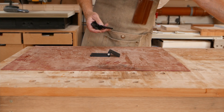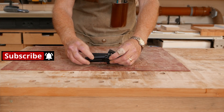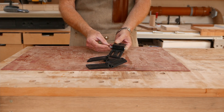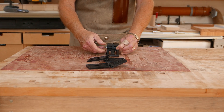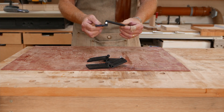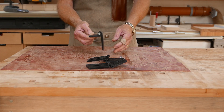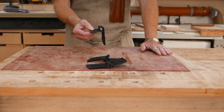It took a number of iterations to get it right — three to be exact — to get the hinge mechanism to fit together and fit together in the right place. And then voila, I've got a flip stop. It'll keep itself in place purely by tension, which is being brought to bear by this bolt with a nyloc nut at the end. The other nut on there is not required — my apologies, it shouldn't be there, lack of preparation. So there's the top bracket and there's the flip, and it flips back out of the way into its own space.